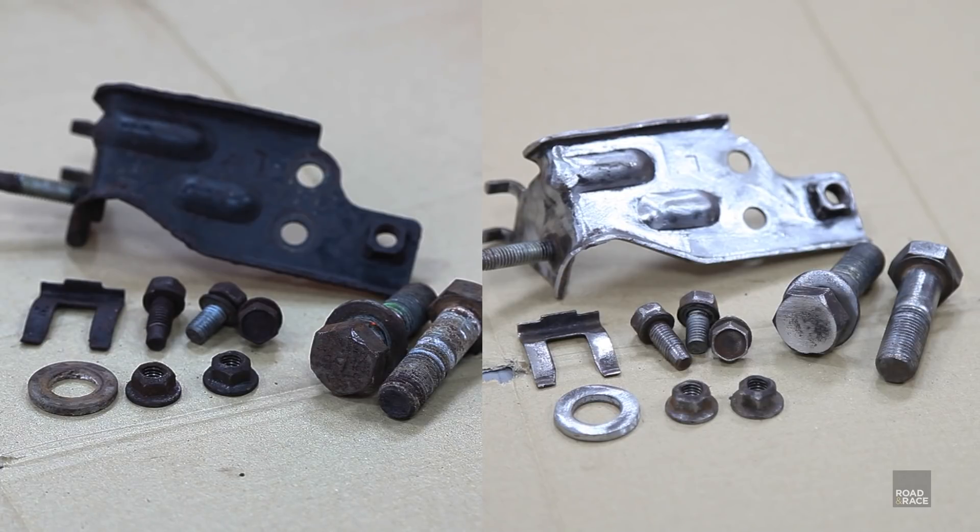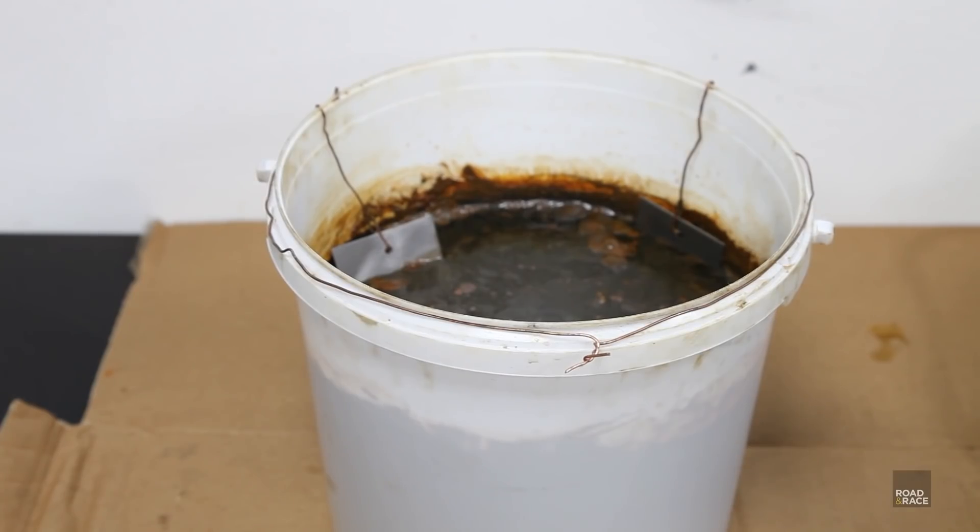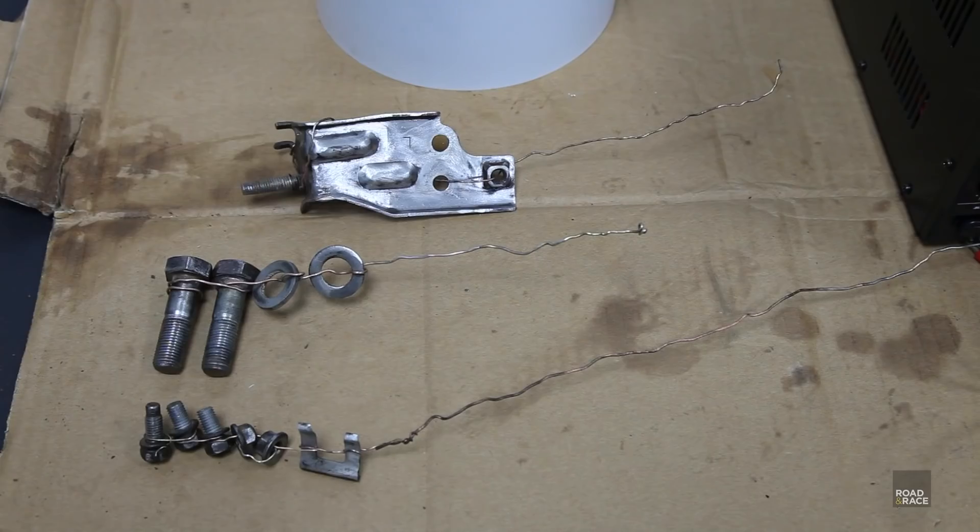The cleaner you can get the parts now the better the plating will be. That said, there will always be some areas you can't quite get to, especially on smaller more fiddly items. So to get the parts rust free in those areas I used another kit from Classic Plating — their Electrolytic Cleaning Kit. There's a loop of copper around the edge with steel plates hanging off it into the mixed-up cleaning solution, and you hang what you want to clean into it.